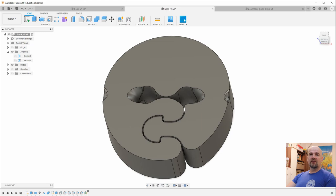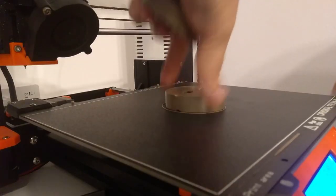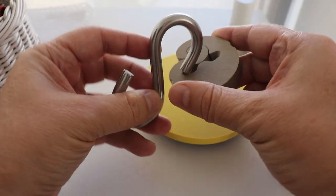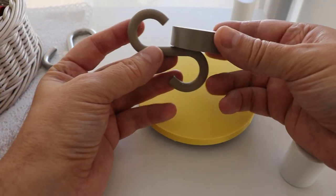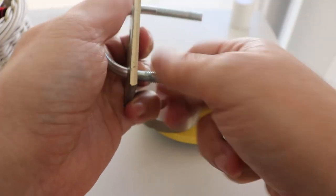I printed it with only two perimeters and 20% infill. You can see this is approximately at half the final size, and the low infill percentage is visible. I used a textured print bed so the parts pop off very easily, and printing is much faster. The weight is a little over 15 grams. I had some metallic S-hooks for testing but they couldn't fit, so just to be sure it would fit in the Polymakers testing hook, I 3D printed one with the given dimensions to verify the hook slides in and turns correctly.